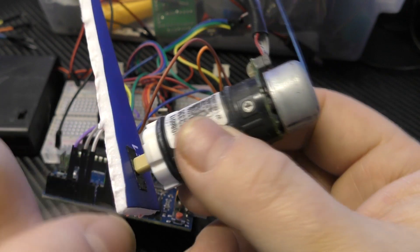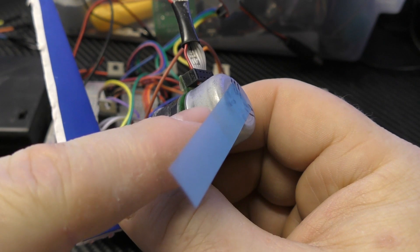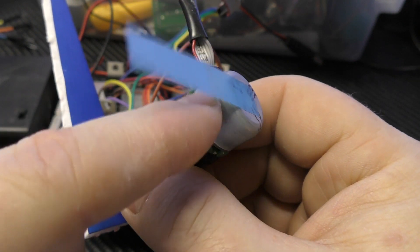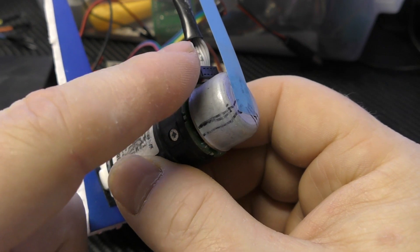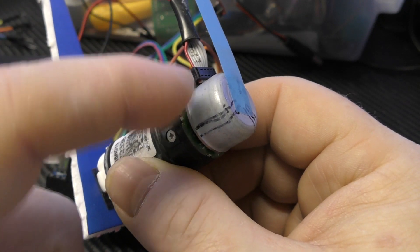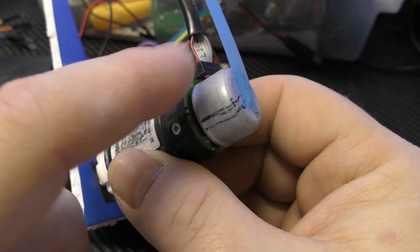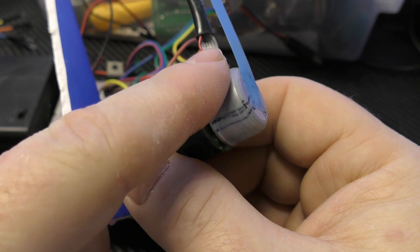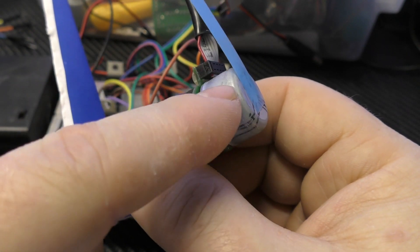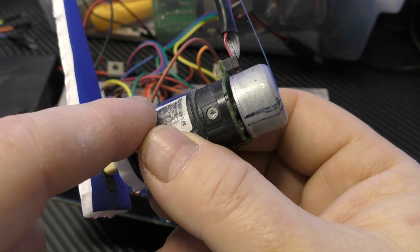Or, in the case of a brushless DC motor, just because they're meant to spin — not move in steps — they're meant to move at specific speeds, so the coils are spread out quite a bit more. But even these, as you'll see when we experiment with it later on, can be pretty harsh in the jumps, unless you use AC waves.